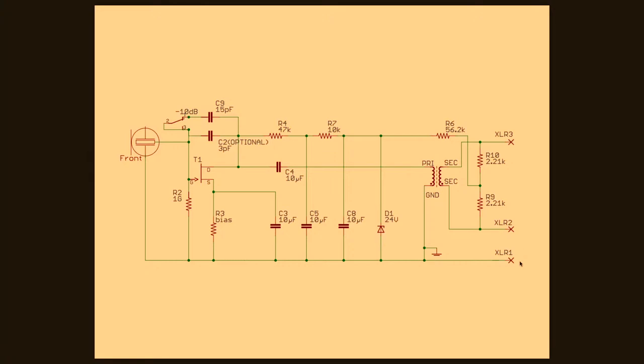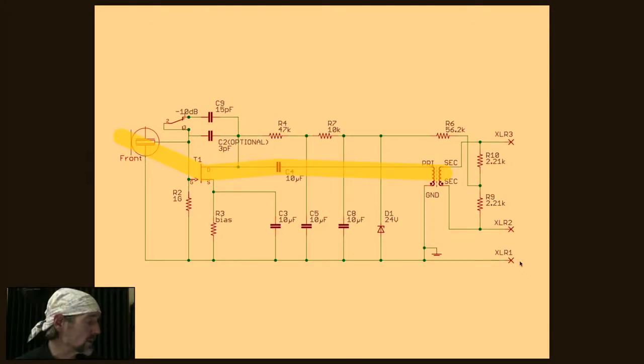We're not going to talk a lot about everything, but let's focus on the signal path. This is actually where audio goes. Audio goes in the capsule, obviously, and then it goes to the JFET. In a lot of microphones, you'll see a capacitor between those two points, but nothing here. This is what's called direct coupled. If there is a capacitor between those two points, sometimes that needs to happen to prevent DC voltage from hitting the JFET or the tube, whatever might be there. But there's nothing here.